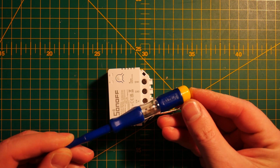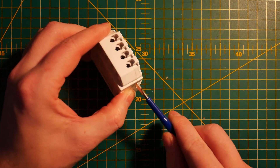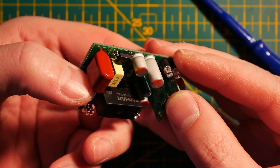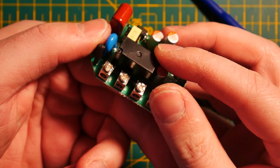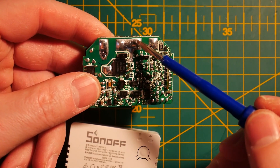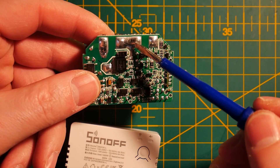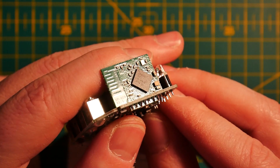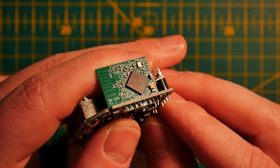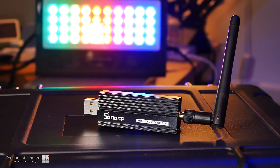Before exploring more options, I want to look inside. I feel a little guilty for bringing a Shelly-branded screwdriver to a Sonoff job, but let's open it up anyway. Inside you'll notice the relay is rated for 16 amps, unlike the official rating of 6 amps, so I think the current limitation has more to do with the PCB design than the relay itself. What's also indicative of my earlier warning is that S1 is fused with Live N — so do not connect neutral there.